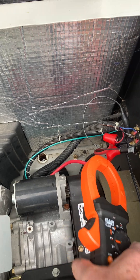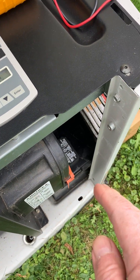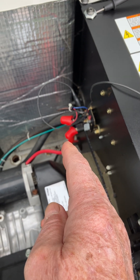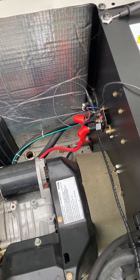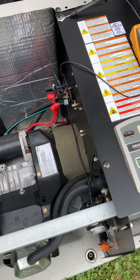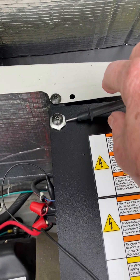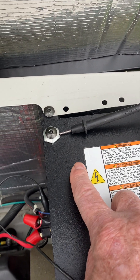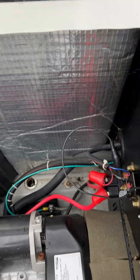I just wanted to show the sequence of events: you have to have the battery, you have to have a start command, it has to connect 12 volts to the contactor so it closes and the starter gets power and spins the engine. If it doesn't get that far, you've got something ahead of it. On batteries — I always disconnect the negative terminal first, because once it's connected the whole machine is negative, so I put my negative terminal for the DC voltage there to read that.